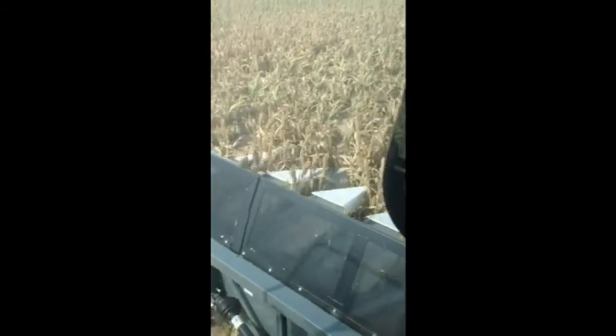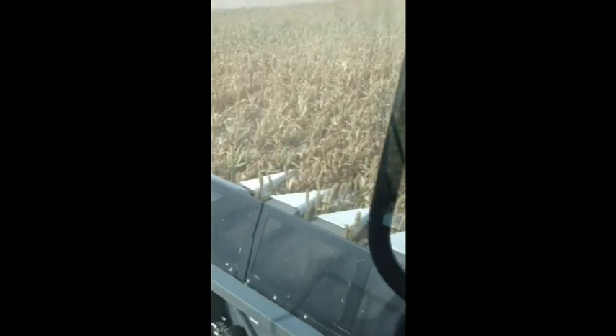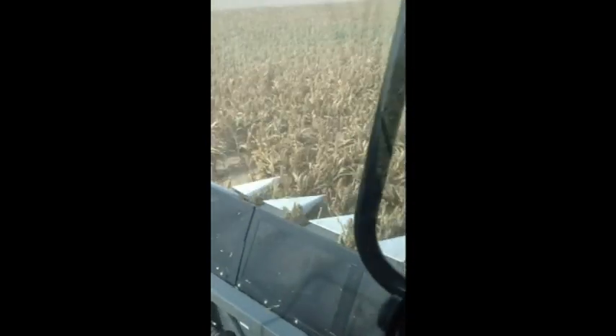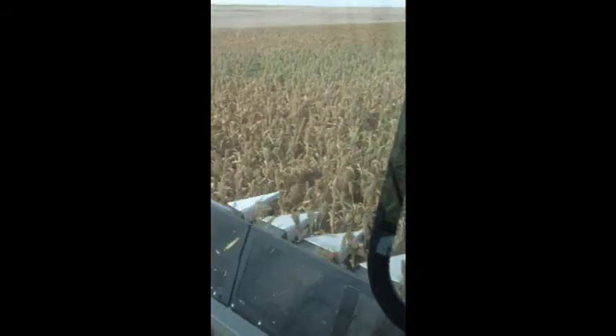Sunflower and grain sorghum farmer Marvin Kaus: What I liked about them was just the knife placement. With the Milo, with your knife clear at the back, you can be getting your crop dividers clear on the ground up front, and you'll still leave 10 to 12 inches of stubble. That's a really neat bonus.